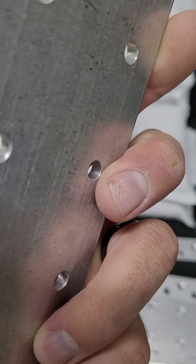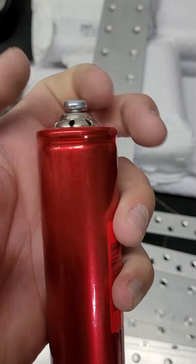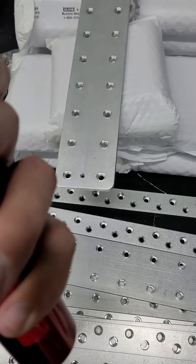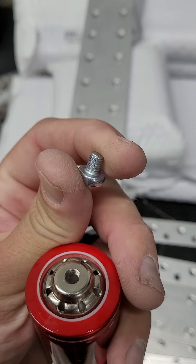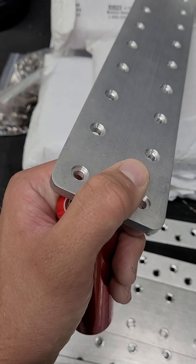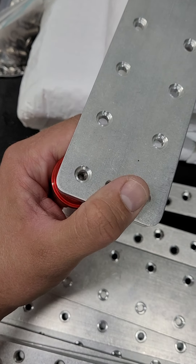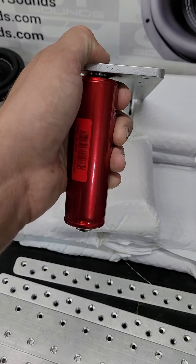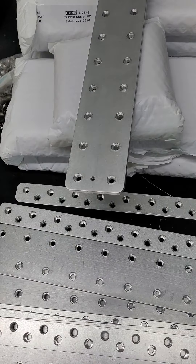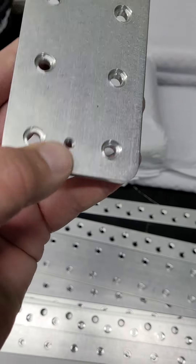What I've done here is bore these down to four millimeters, so this hole right here is four millimeters deep. Four millimeters plus five gives us enough room. I use an eight millimeter long bolt — when I put it on here it just bolts right up. I have just a tiny bit of clearance when I bolt this on with the eight millimeter bolt so it holds on tight and doesn't bottom out. I built these before where it bottomed out on a 10 millimeter bolt, so I dropped it down and switched to an eight millimeter bolt and haven't had any problems since.